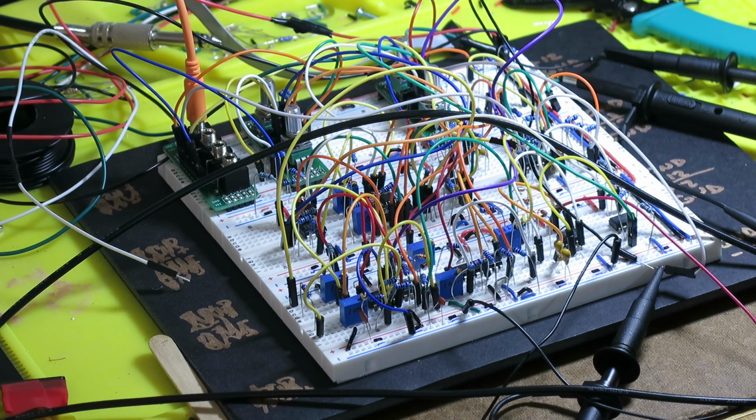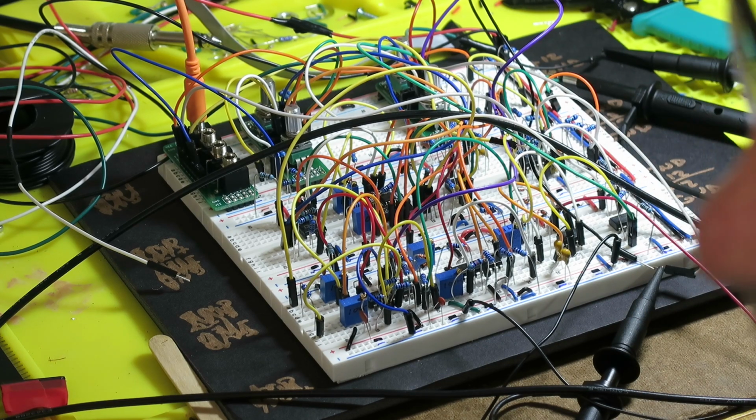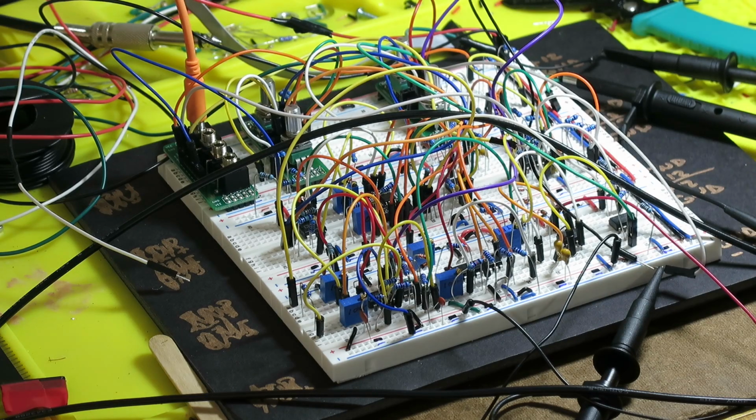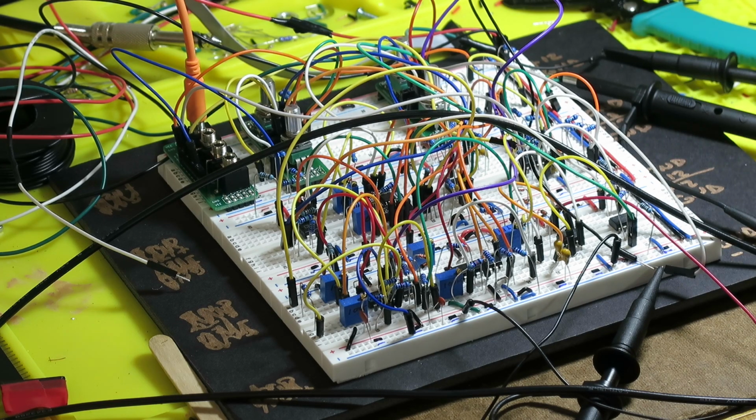One other thing I did. There is a JFET transistor in there, which Wilson specified as a PN4391 JFET, which I don't have any of. So I got out the JFETs that I did have, and I tried all of them. There was a 2N5457, which is one that Wilson mentioned as a possible substitute, 2N5458, J111, a J112, which again Wilson mentioned, and a J113, and they all work in the sense that if you plug any one of them in there, the oscillator oscillates.